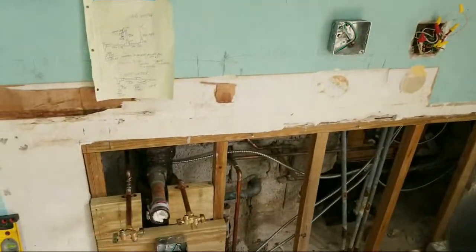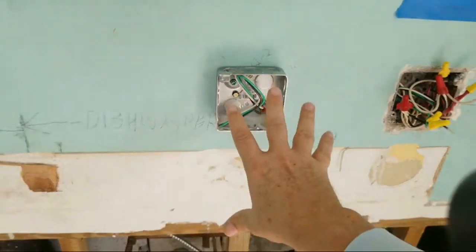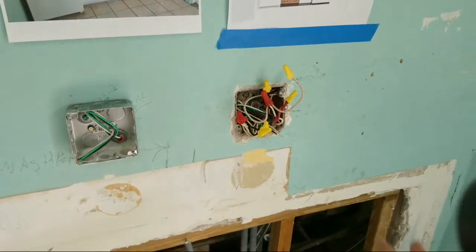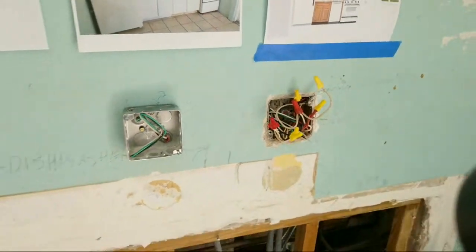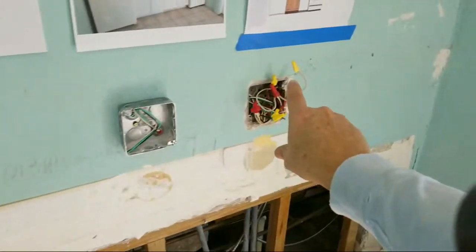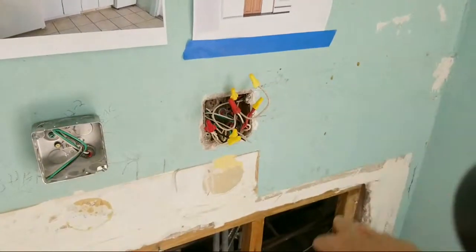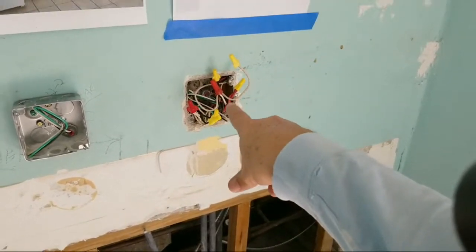This is the outlet that's going to be above the kitchen counter. This was the old outlet and we have to put a plate over it — that's what stinks. We're hoping the stove will cover most of it, and we'll probably have a backsplash here that will cover some of it too. But you still have to have the plate by code, because you can't have any hidden junction boxes. That's a mistake a lot of people make when remodeling — they'll go right over something like that, and you can't do that. It must be accessible.